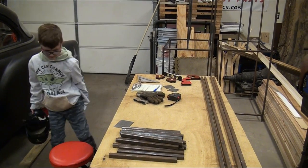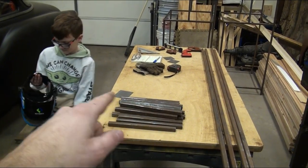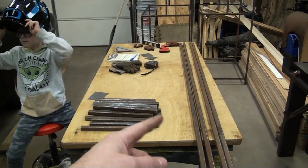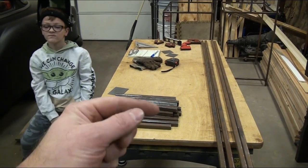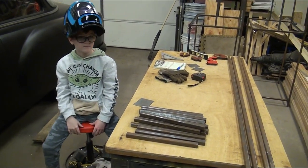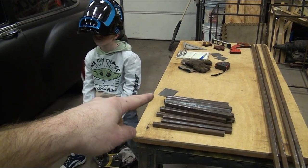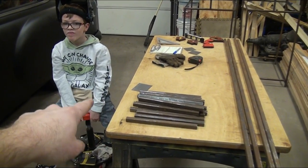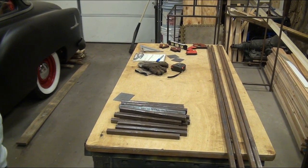These are welding magnets, so it's nice because you don't have to clamp or hold the pieces together. We're just doing 90-degree angles — you could do 45s or whatever — but we're going to do 90, so we could literally just put the magnet on it and attach the other piece. It'll hold it in place so that when we get ready to weld, it's exactly where we want it to be. The tubing is all three-quarter inch square, so we're cutting that metal at three-quarters of an inch wide and an inch and a half long, giving us enough room to get a drill in for the anchor.